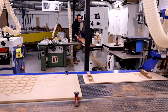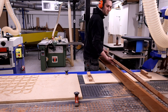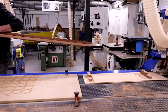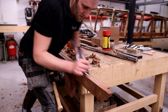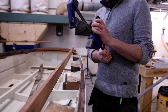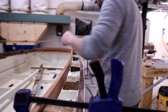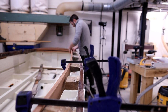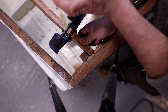These carlins have quite a key role in strengthening the side of the boat. The deck is a bit overlooked in the role it plays — it actually does a lot to stiffen the structure. This is one of the reasons I got to the point of priming the boat and then as I was fairing it I was thinking the sides of this are flopping around quite a lot, so we need to do the deck structure to stiffen everything back up before we proceed with the final paint process. We put some new carlins in place, a little bit thicker than the originals — just a couple of mil — to give some extra stiffness. This plays a key role in the general stiffness of the whole boat structure; it's stopping the top from flopping around and it's almost as important as the bottom.